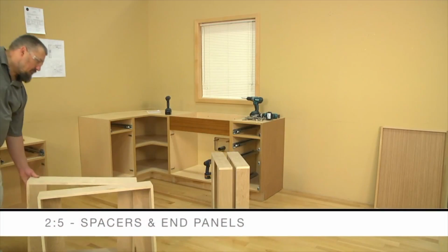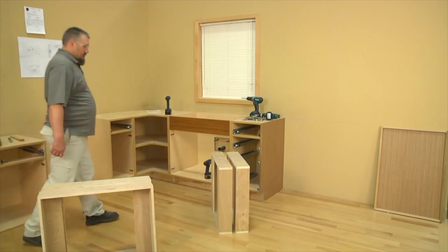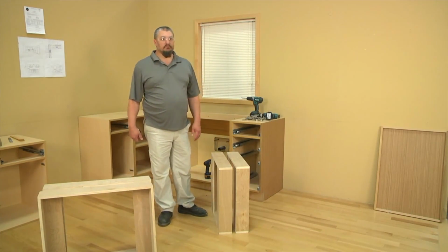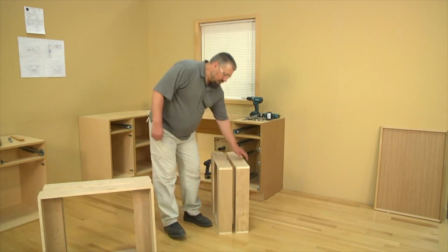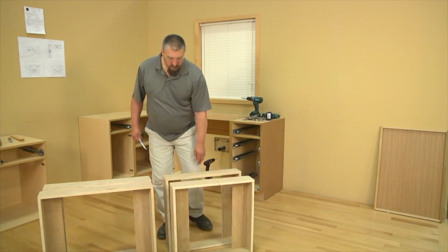Placing cabinets adjacent to appliances is another critical point. Be sure to have the appliance specs on hand to verify the space required for your different appliances. In our kitchen design, these were pre-marked earlier. You can follow the lines, but a more preferred method will assure a good square install is to use appliance spacers.